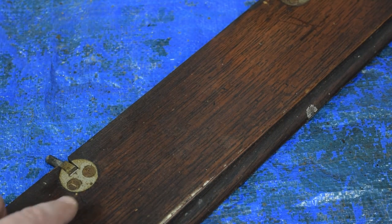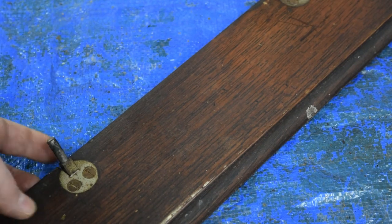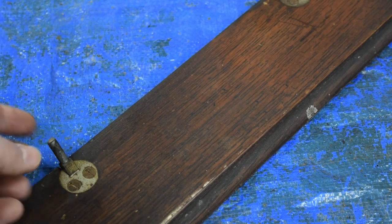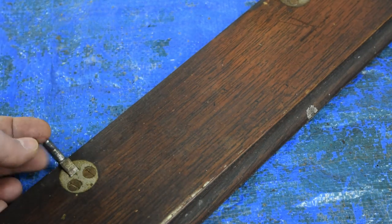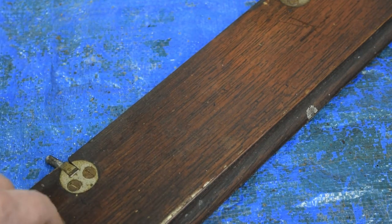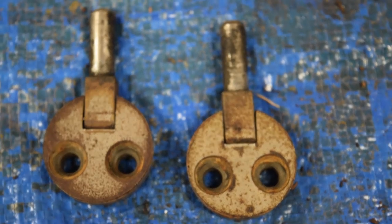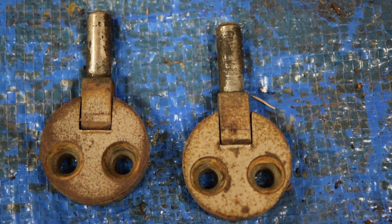And the final bits of hardware that have to be removed are these assemblies here. These are the actual pieces that the machine mounts to, and it hinges to allow the machine to drop down when it's folded up. These just come out with two screws apiece, and we're all done. And there's what those two little hinge assemblies look like removed from the cabinet frame.